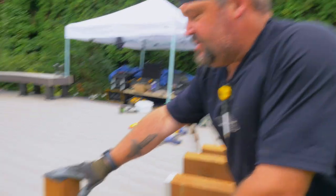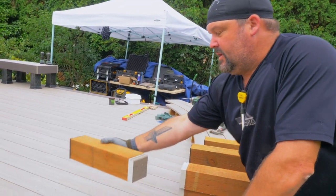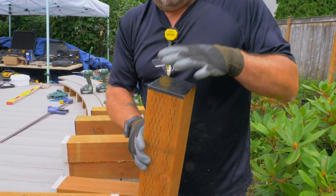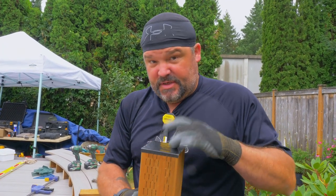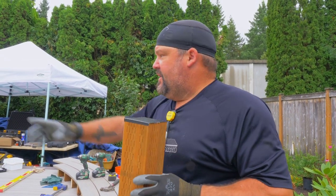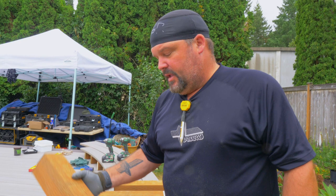We put a little bit of G-tape on the top because when you have lumber sitting straight up, the end cut is straight up, moisture is gonna sit here and absorb in and decay. When lumber is sitting this way and moisture hits it, it's not gonna absorb as much. So whenever we have exposed end grains, flat blocking, or anywhere water can absorb, we always put waterproof membrane tape on it. This faces up on this particular bench, and we put the AZEK on the bottom so water doesn't soak up like a sponge into the post bases and cause rot.